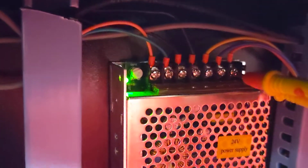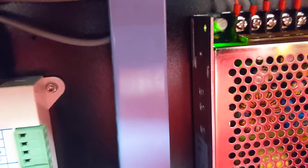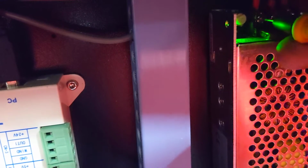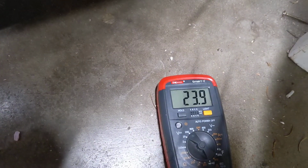And you do have to be a little careful because if you cross things up, it's bad. So, doing this one-handed, odds are good I'll mess it up. So I got nothing there, that's interesting. Oh hey look, it's got markings right here. Hard to see, but under this flap there's markings. And we've got 24 volts. Another red and black pair. Let's try these 2. Let's be really careful not to ground something out by accident. Sweet. Now on the multimeter, we can see we got 24 volts.